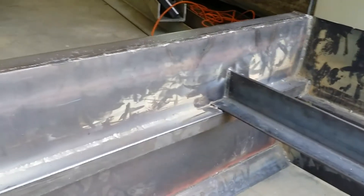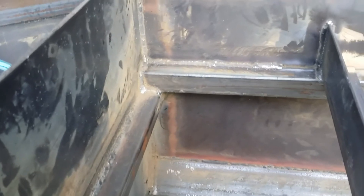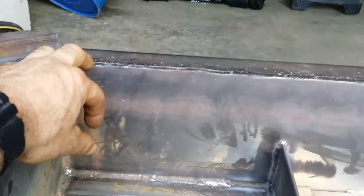As you can see, I've got plenty of penetration. Here's the line from the back side of the 2x2 tube on the back reinforcement. My three-point arms sit on the 2x2 tube, and then the one-and-a-half sits on top. If you push backwards on this, you've got support here and support here on the back plate — they're also supported by the pieces of angle I put in the corner right here.